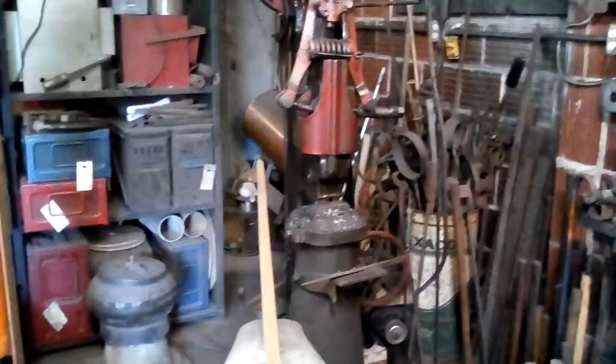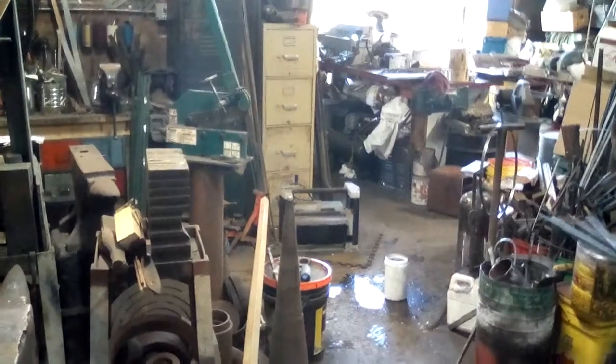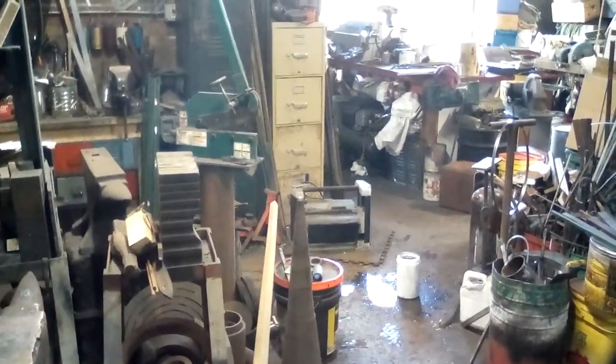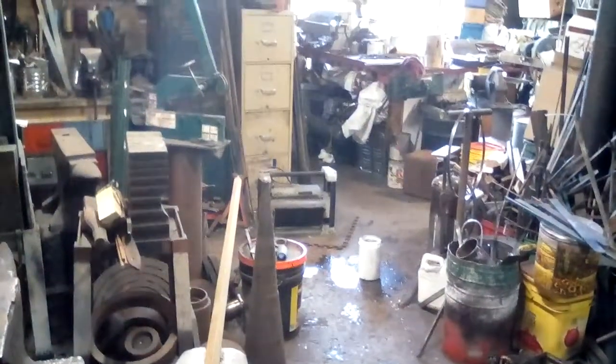is that it's set up in a very particular place. If you have a long rod, I have it angled past the trip hammer in that direction, and in the other direction it aims off and points toward that filing cabinet, so I have a clear space. So theoretically I can have a 15-foot long bar in the vise and have clearance for it, though I seldom ever need anything that long. But it's not just an accident to have a vise with clearance. You need to actually sort of plan that out.